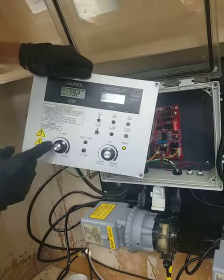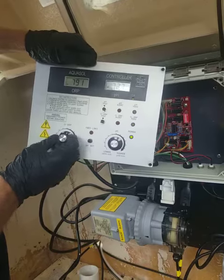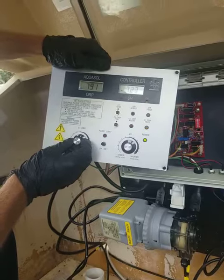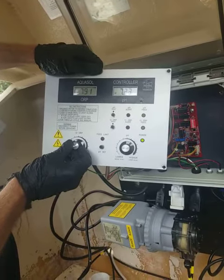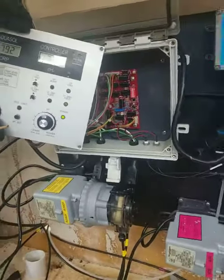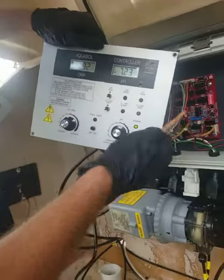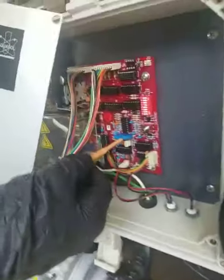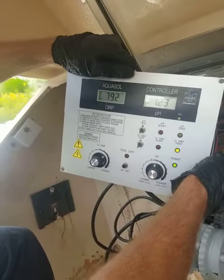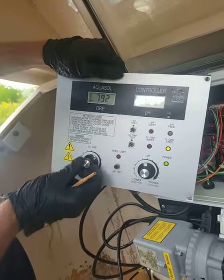It's important to remember that these are 22 millivolts each — these notches on a red board, 44 on a blue board. These don't correspond directly to like half points or whole points of chlorine. We're going to put our 7.5 up here, and to do that, first we put our knob where we want — our 5.0 on our chlorine. I'm going to adjust this screw on the left until the bleach pump, the ORP feed, turns off and on right here. That's our 5 on the chlorine.